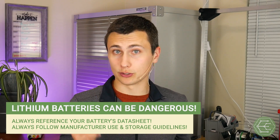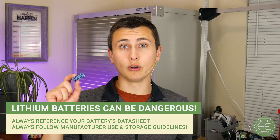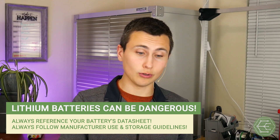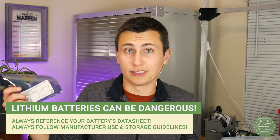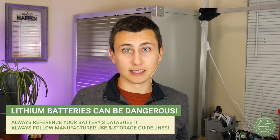There are three major tests we want to run today with this charger: exploring the different points of the lithium battery charging curve, the constant current, constant voltage, and cutoff modes of the controller. On the boost converter side, we really just want to measure how the system performs with and without a battery. We'll explore that at light load and full load, assuming we can get there.